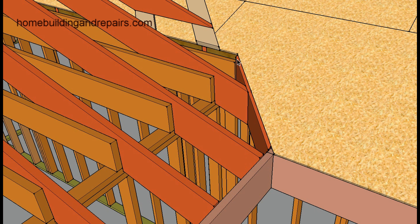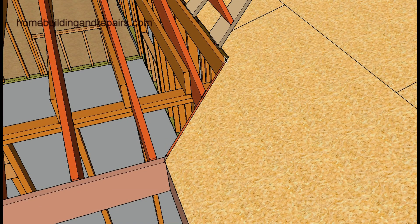Here's the top view. The hip fill plywood or roof sheathing is sitting half on it, stopping here so that we can insulate. There is something I want to mention — even if the roof sheathing is coming down here, sometimes when you run these fill boards down they're going to be blocking some of the insulation, so that's something to consider. This method right here is going to have plenty of support with the roof sheathing sitting on top, and this board really wouldn't need to go all the way down to intersect with the rafter.